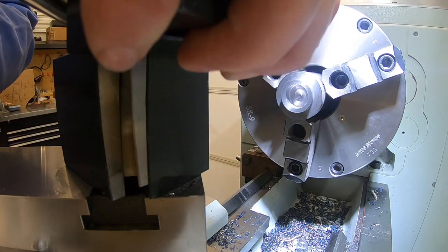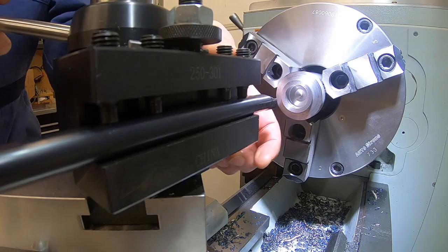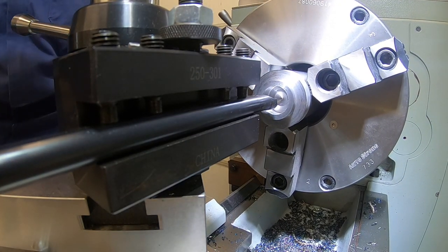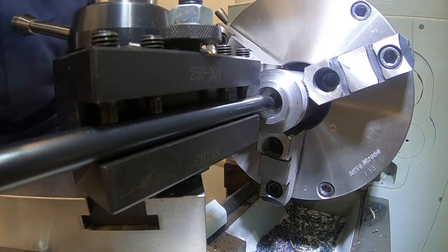This bar works in a 1-inch hole and bigger. It is not going to work for us to finish a hole out to 1 inch. Back to our other bar, same concept. We're still gonna take our same 3 cuts. Let me reset my 0.